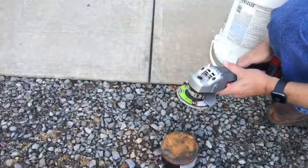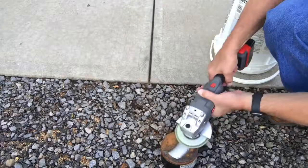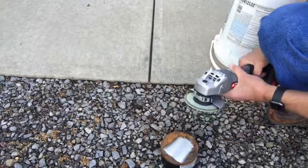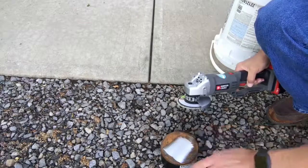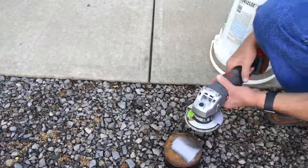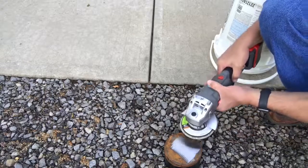Safety first — I'm going to grind that surface. When you're preparing the surface, you'll notice a tendency of lines that go in line with the direction the abrasive is going. So it's important to do a little crosshatch pattern just to even things out and make sure you eliminate any waviness.